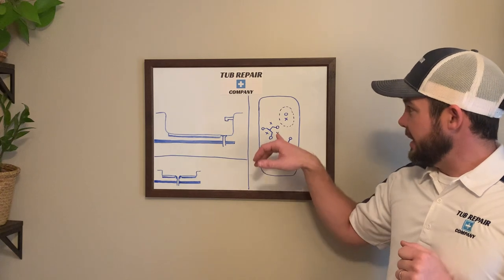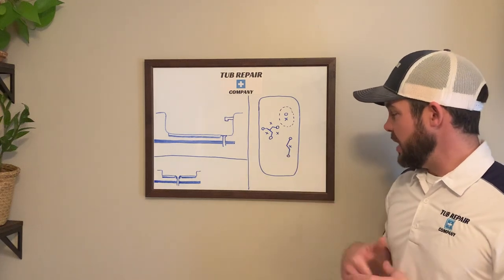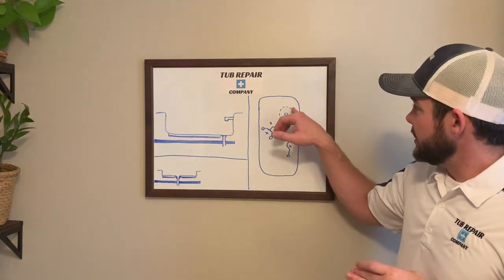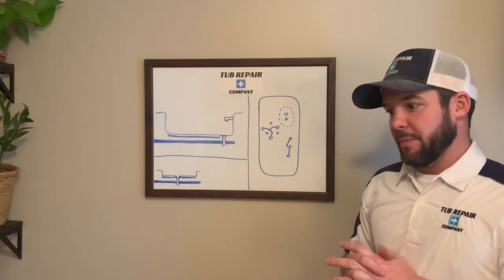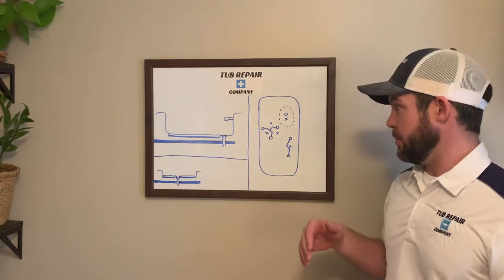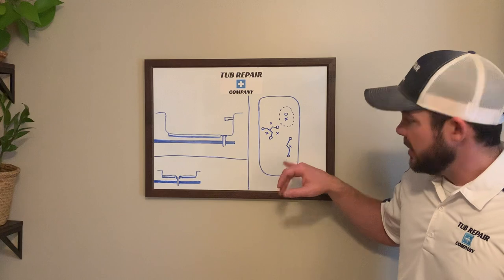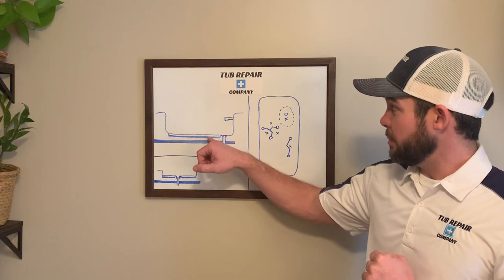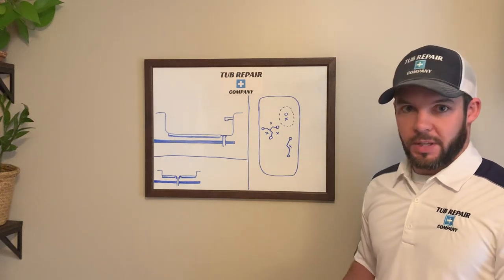Here's an overhead view of a tub floor. You've got different kinds of cracks — some with multiple ends, like three ends, and a lot of cracks are just a split with two ends. There's also the soft area scenario where the tub hasn't cracked yet but you can feel it — you can go ahead and add support to prevent it from cracking. The O's on the diagram are your deep layer support holes — these go through the floor, through the support board, all the way down to the subfloor. You'll really feel that firm support when you hit the subfloor.